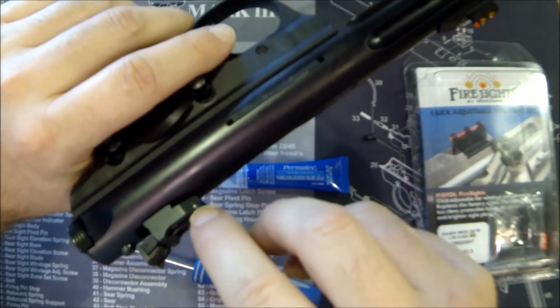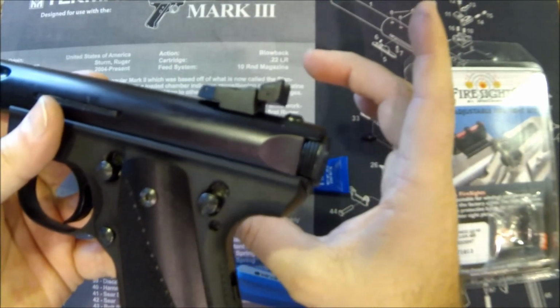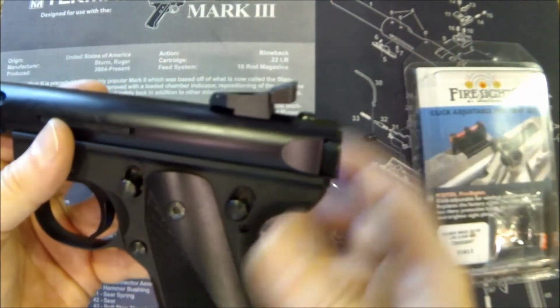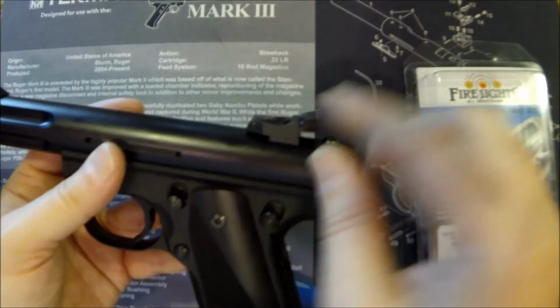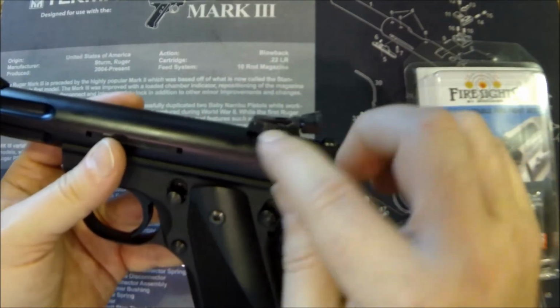And then here's where you want to pop up that pin. So I recommend putting this up on a block or a roll of tape of some type. You know, duct tape works really well. If you've got a bench block, great. And then you're going to want to hammer this front pin out, because that front pin is what helps this pivot for the adjustment. And that's the pin you've got to remove.